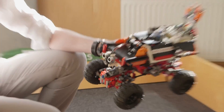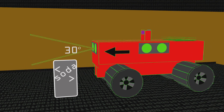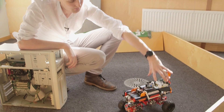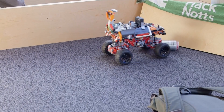This isn't perfect — the robot is actually quite naive. The sensors on the front, back, left, and right are good for about 30 degrees of range, but there are blind spots on the corners at the front and back by the wheels. Sometimes this isn't great because you can hit very thin obstacles which the sensors don't necessarily get in range, such as a pole.